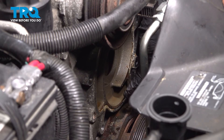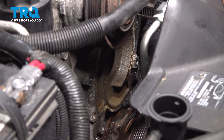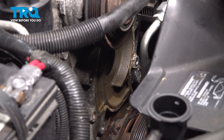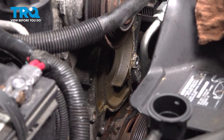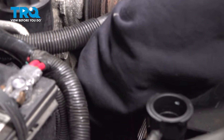Now we're on the perimeter on the front side of the block. There is a bunch of corrosion and debris on here. We need to clean this and get it down to the aluminum before we install our new water pump. I'm going to use some spray solvent on a rag to start with and go around the perimeter, cleaning up as much as I can.